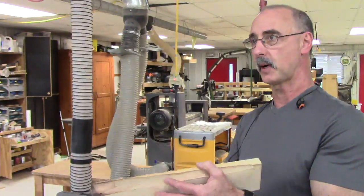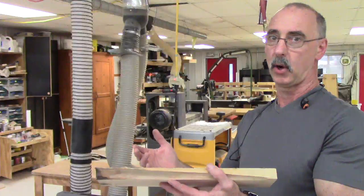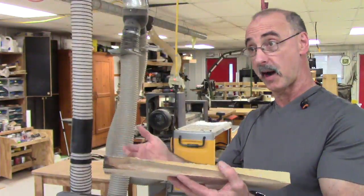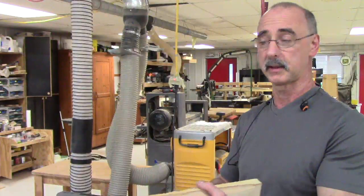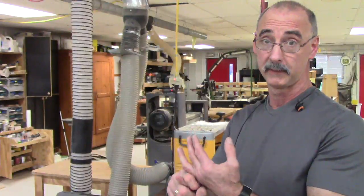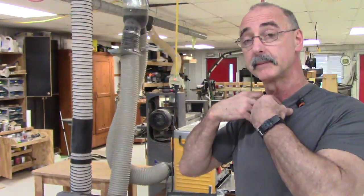So back to Michael's question of, is there wood that can't be made straight? Well, no, because even with that 1/2 inch twist in 8 feet, we could get that board straight. You're going to cut off a 1/2 inch of wood to make it right, and then plane it to your final thickness. So the important thing out of this, I think, is making sure the wood you're using is stable, and you're using the right tool sequence in order to make it happen.